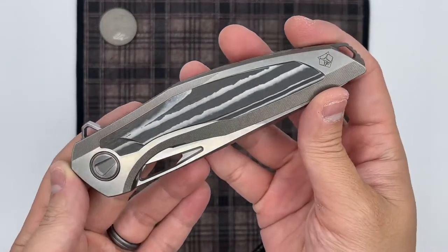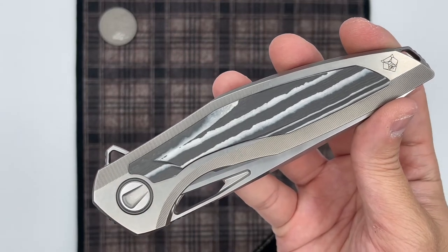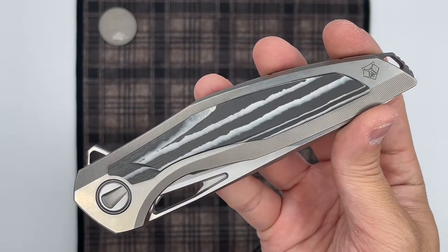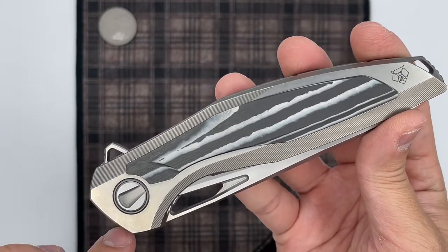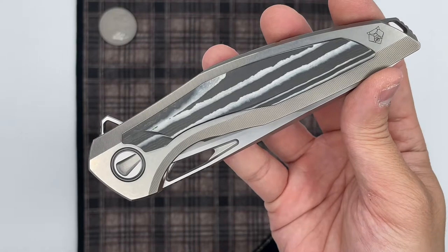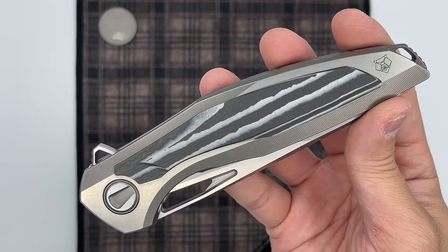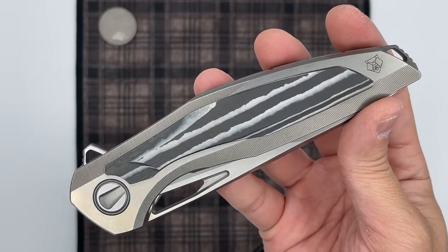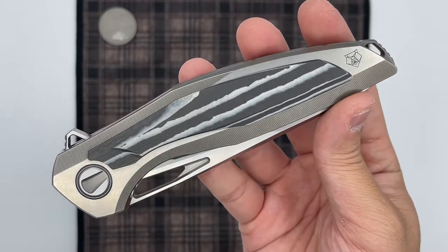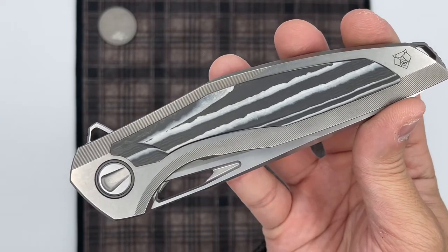Moving on to the handle, we can see here that we have the newest updated large pivot screw. This is also indexed with a ball bearing underneath so that the pivot is not free-spinning and is clocked in this direction permanently. Because of that larger pivot screw, we also have a reduced diameter pivot collar here. The overall diameter of the counterbore drilled into the handles is the same, but because we have that larger diameter pivot screw, they had to reduce the inner diameter of the pivot collar. The pivot collar is zirconium, which goes very well with the black and white carbo quartz. The finish on the main flat part of the handle is this tumbled sand finish that Sergei has become quite partial to in recent years, and we're seeing it more commonly used on the customs and also on some more limited knives as well.